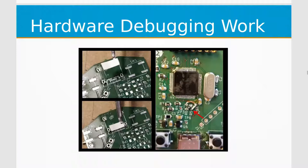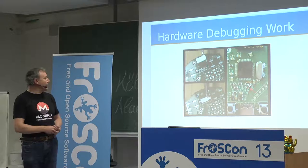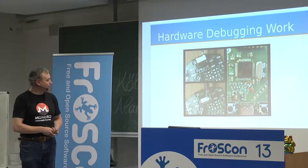Once we do have a board finished, we can refer to the design and make some considerations. For example, what happened to us once is that the USB connector was not working properly, so we put that under a microscope and realized that some of the circuits that we had designed were incorrect. So we did some debugging and hacking here. We changed the resistor, which is normally straight, to be at an angle here sideways. We shorted the two connectors there with a wire, and we masked off parts of the USB-C connector.